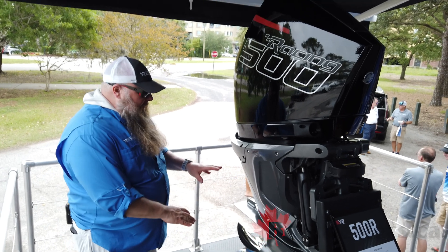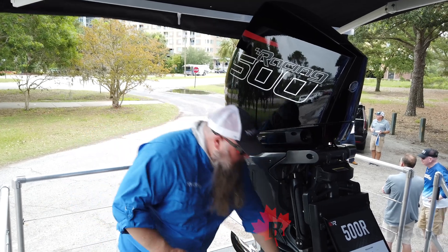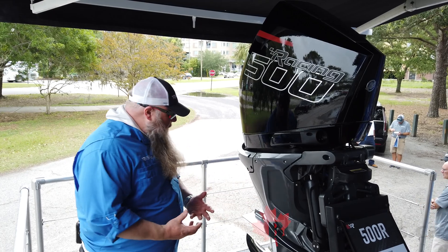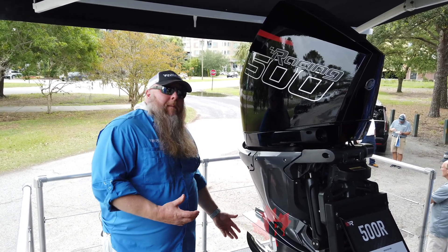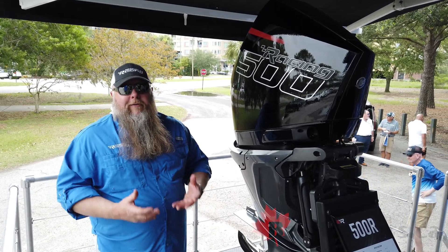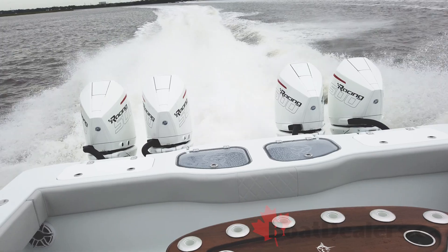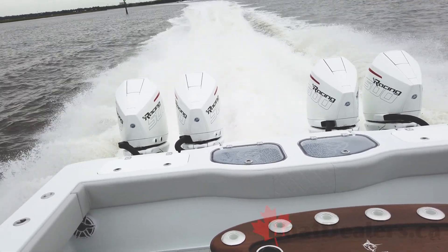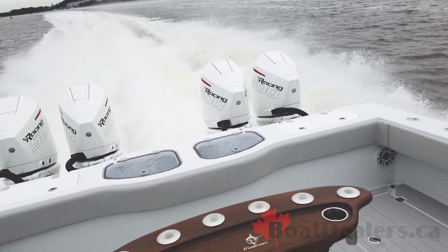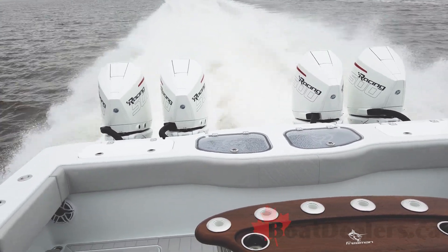The Drive Sport takes it to the next level. It's got a longer skeg with a slightly different profile and a different nose cone that peeps out a bit more for maximum performance. Most importantly, it has a much stronger prop shaft because the Drive Sport is the variant designed to run fully surfaced. Running fully surfaced means you have the highest amounts of loading and unloading on the gear case. The prop shaft on the Drive Sport is made from an aerospace stainless steel alloy, very similar to what we use on our M6 and M8 stern drives — very rigid, very robust, and very strong.